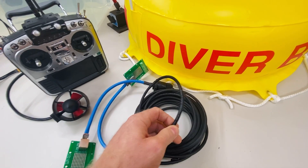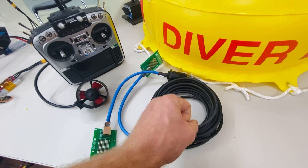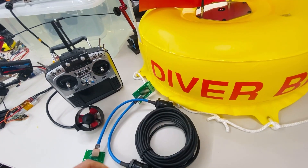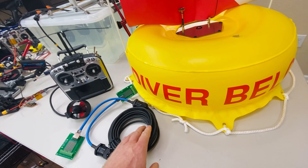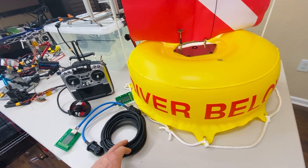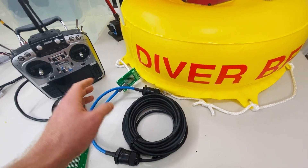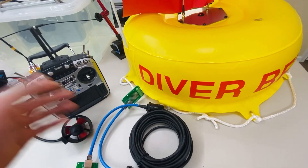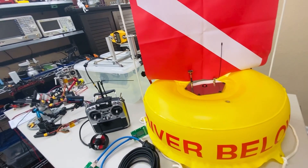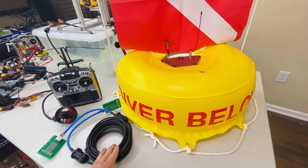For the tether, for now I'm going to use a CAT8 cable — it's shielded — and I'm going to design these little float clamps that attach every foot or so. That'll keep the cable somewhat buoyant and keep the tether from tangling underwater. You can find neutrally buoyant cabling that's actually designed for this purpose, but it's extremely expensive — like two hundred dollars for a length of cable — so I'm just going to use this for now.